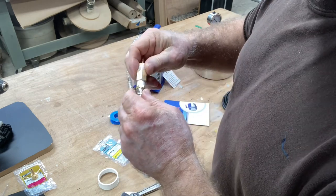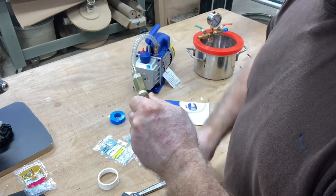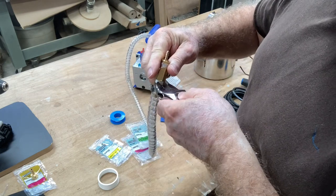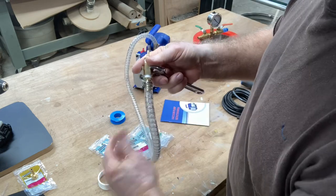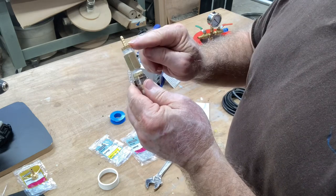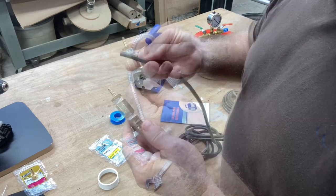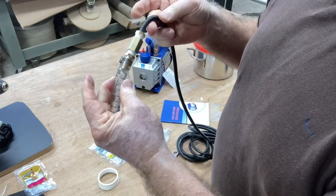Now that the Teflon tape's on there, let's just screw it right on to the other end. I'll grab the adjustable wrenches and tighten this about another quarter of a turn, just to make sure that it's snug. This completes the adapter to make the transition from the 3/8 hose from the vacuum pump itself down to that landscaping irrigation line. That was an eighth inch diameter. All I will do is just slip that hose now onto this barb end and it will be ready to test out.